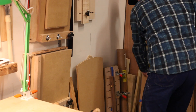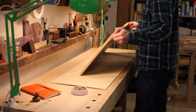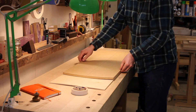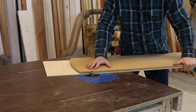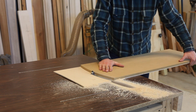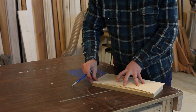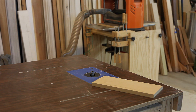Now we're going to get started on making the clamping cauls for gluing the edge banding to the top and bottom of the sides. The sides have a radius that I've used a compass to trace onto an MDF template and cut out. I need the other side of that curve — the negative template. I'm double-stick taping that MDF template onto a piece of eighth-inch plywood, then running that through a pattern bit on my router table to cut it out. That gives me the other side of the curve. Then I transfer that curve to a piece of three-quarter MDF, go to my bandsaw, cut it out staying about a sixteenth of an inch off the line, and then come back to my router table to pattern-rout it out.